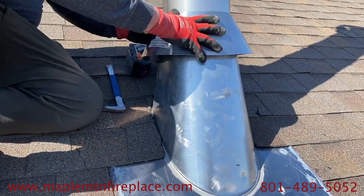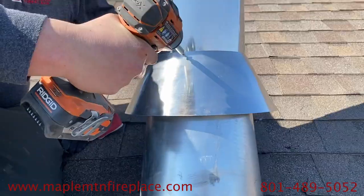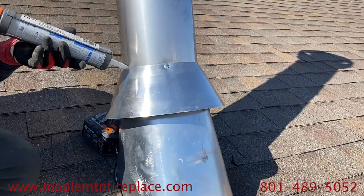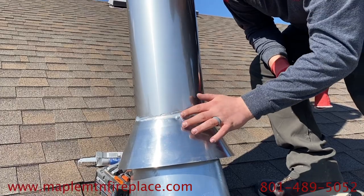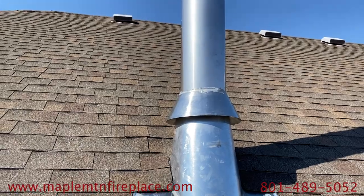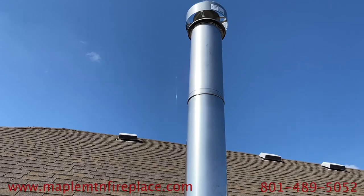And the storm collar — as you can see the top of the flashing was vented, so that allows for the pipe to cool off a little bit. Now we're just putting that storm collar on, and also an extra layer of silicone to prevent any leaks running down the pipe. Here it is — our chimney is out of the roof about five feet. So no requirement for a roof brace, but if you want to do a roof brace, by all means do it.